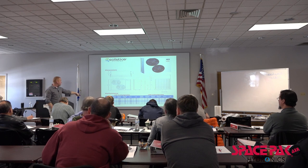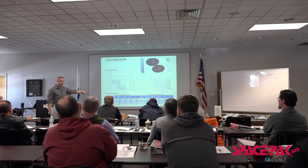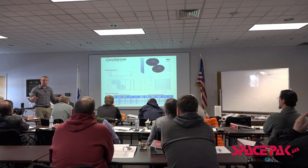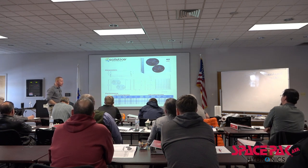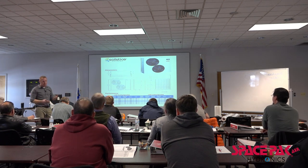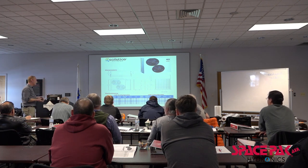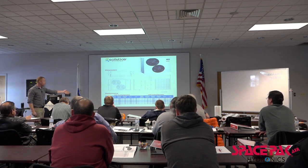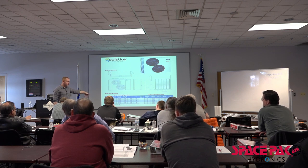But in doing that, there comes a point when it gets so cold out that the load of that 5-ton air handler comes on, it's over 40, I'll drain that thing right down, right? It just won't make that water temperature because the load is too much. At which time, we have some options: we can incorporate resistance element heaters in our buffer tanks and things of that nature. At 110 degree water, we can deliver 37,000 BTUs. If it's 47 with 130 degree water, we're almost 70,000 BTUs delivered.